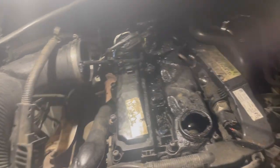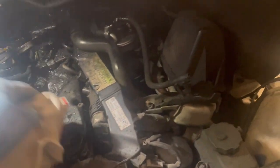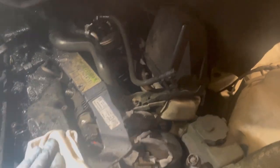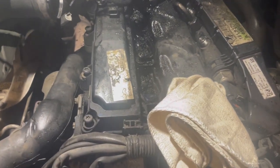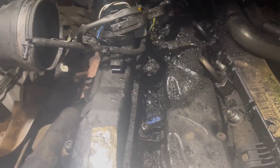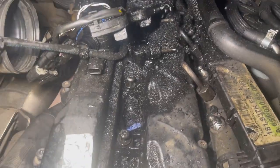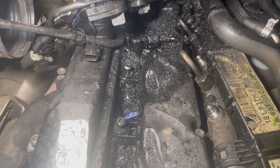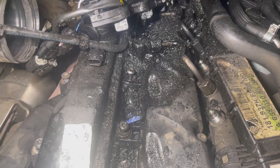So, one, two out there. There we go, nothing will go in that. So, two injectors out, just patience and clearing it and chipping away at it, soaking it in mech oil. We use a freeze spray, which helps a lot as well.